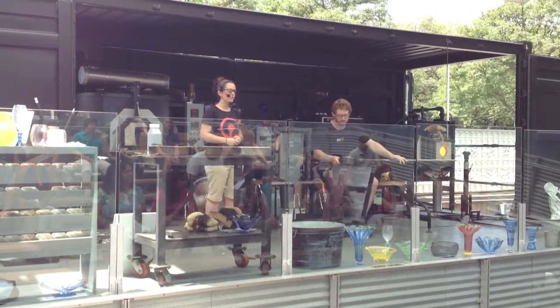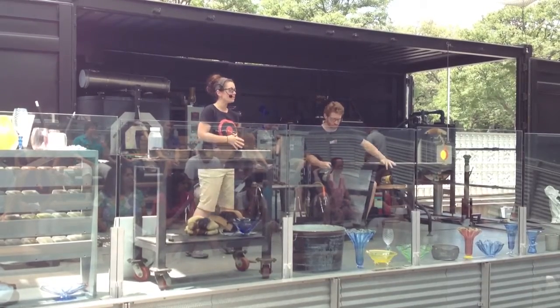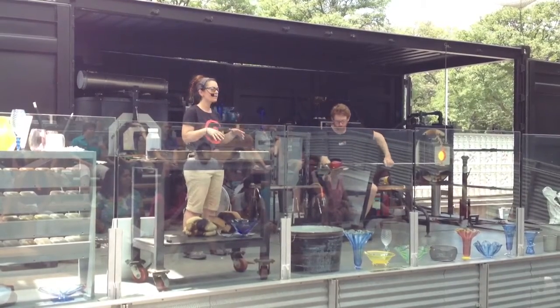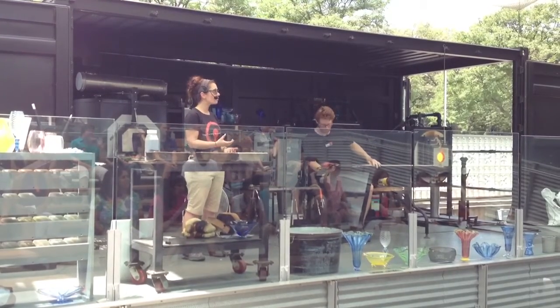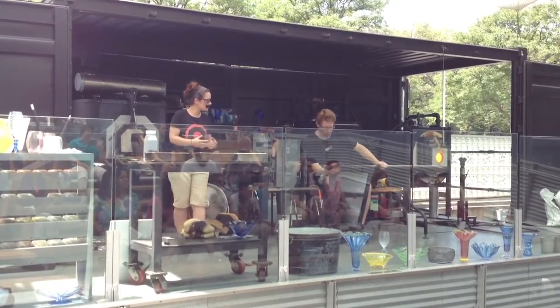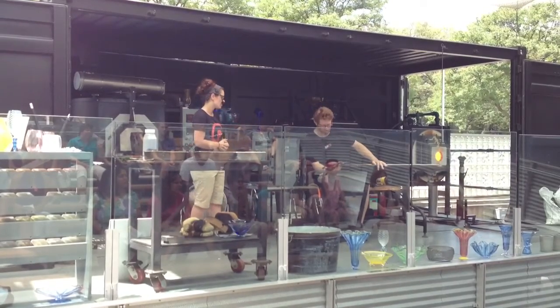Once again, he shapes and cools the new molten layer. The core bubble on the inside is now wrapped in 2,000 degree glass, so it starts to absorb that heat. Once the temperature is even throughout the glass, it will move all at the same rate. So that's how we let our starter bubble get very cold before we gather over it, because it needs to basically not heat up so fast and stay stable so that Dane can collect the glass nice and evenly and make his way back over the working bench.